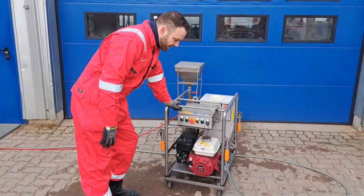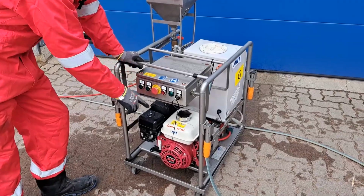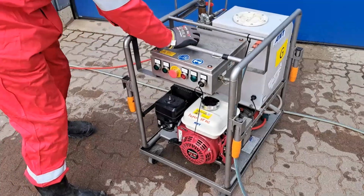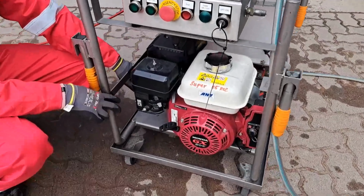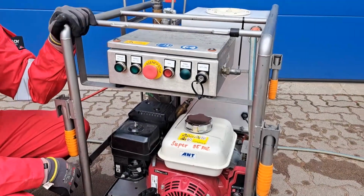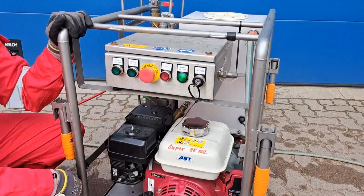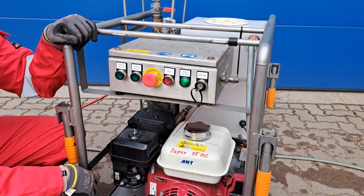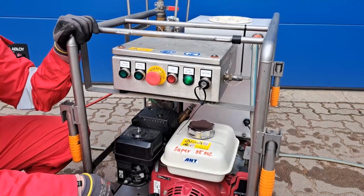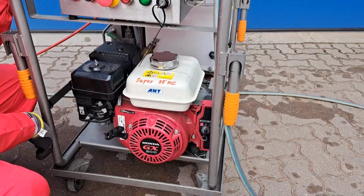All right, starting the engine and the miniMACE. We have our control unit here with the key switch, and we have a key switch for the petrol engine. Battery is connected, it's fully loaded. Switch on the key switch. As we see, nothing happens. Most common failure is emergency stop. Hop. See, it starts to boot. Once it's finished, we have a solid green light. There it is. Then we can go on and put on the ignition.